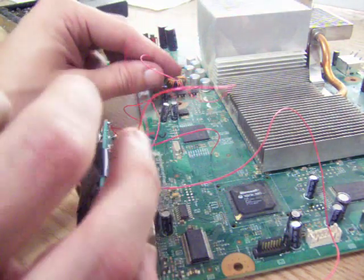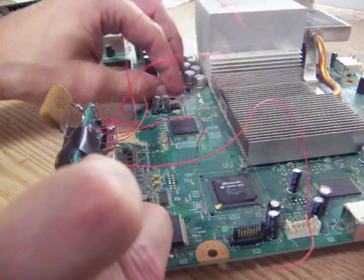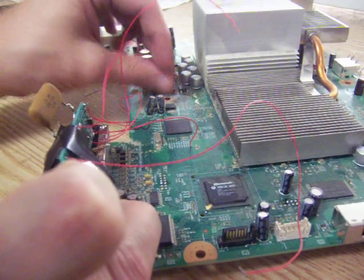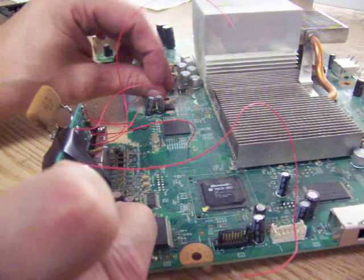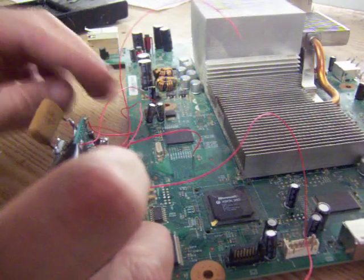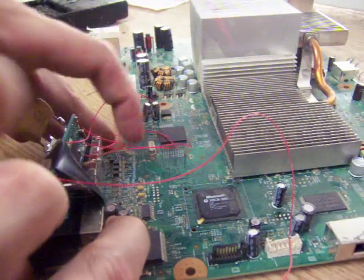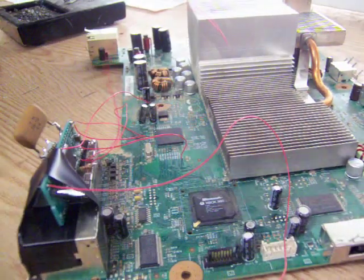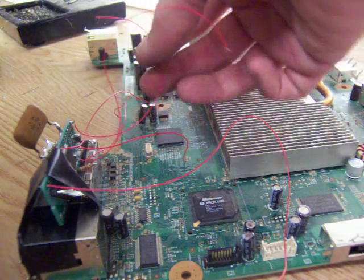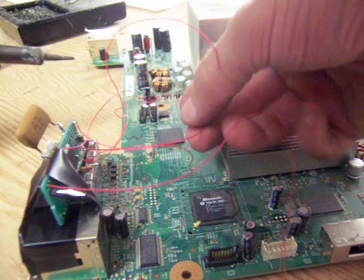Since I'm using all the same color wire, that makes it easier to know which one is which when the board is flipped over so I don't have to look at the Cmod again. I can go ahead and hook up the ground wire while I'm here — that one's not going to be dangerous. I want to wait to hook up the top wires until I've got the bottom done first.